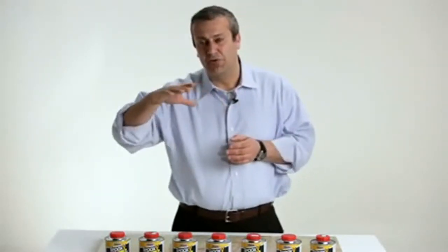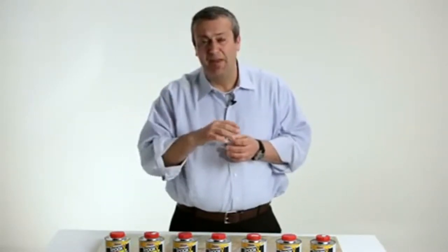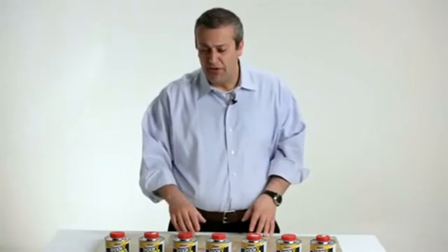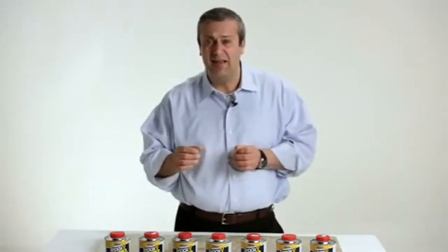So let's say you stop your polish before applying the Tepox at a 400 grit. Now when you continue polishing, you go back to an 800 grit. So you continue the polish all the way to your buff, and the color at this point will remain the same and match your surface. It's important that you work, especially when you first apply Tepox, with as dry a stone as you can. Water in a slab will prevent any application from going back into the stone. So you want to work with a dry surface.